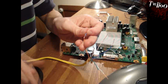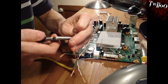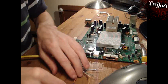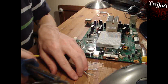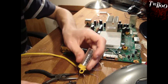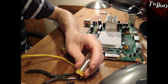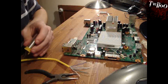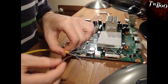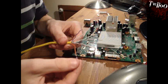So there you go - grab pliers, squeeze it a bit tighter, and add a little bit of solder. Just hold it down. That seeped straight through and it should all now be held together quite nicely. Right, you want to do that with another four, so you want five wires with the resistors on in total.